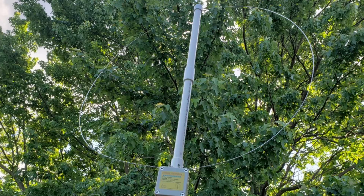When I tested it in the front balcony, it was unusable in shortwave. I had too much FM breakthrough, and a lot of you were saying I need to put a filter on the radio — but no, you don't understand. This is an amplified antenna. The breakthrough is happening in the antenna's amplifier, not on the radio side of things.